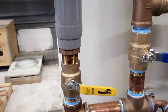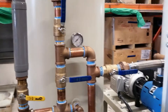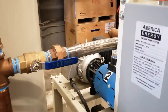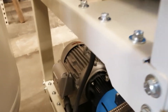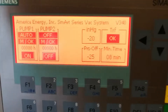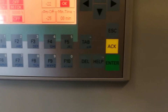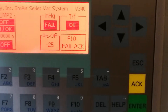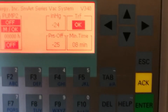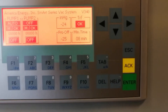We are closing this test valve with our silencer in the factory and the pump is now running. The pressure will be increasing, and when the pump satisfies the pressure level and also the minimum operation time, the pump will be turned off.